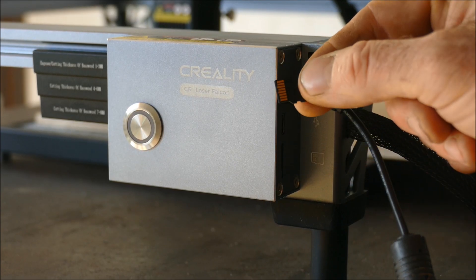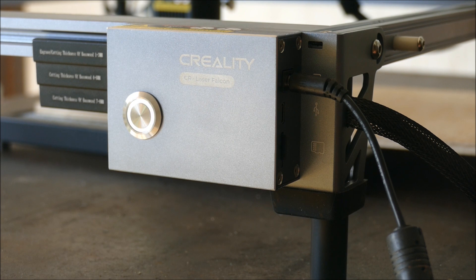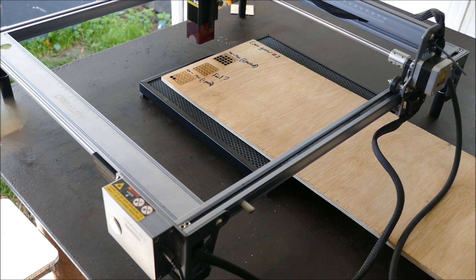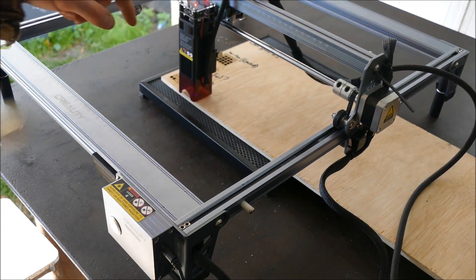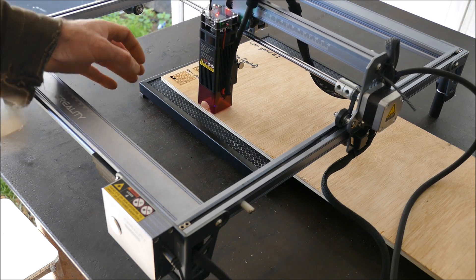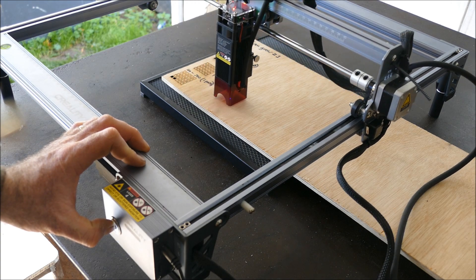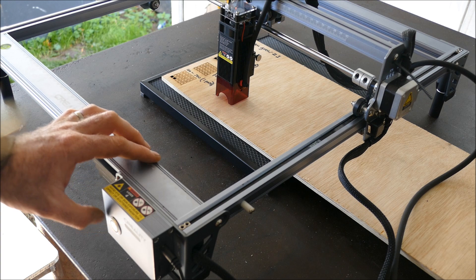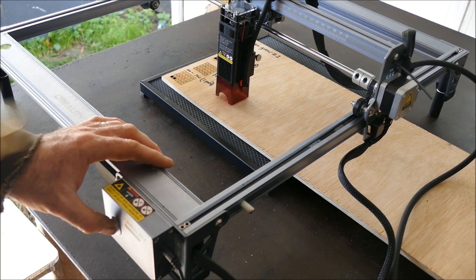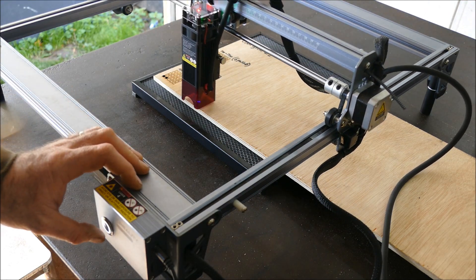Let's now test Creality's cutting capacity. We'll insert our SD card just in here and turn it on. Those beeps let me know it's ready. So the first time we press the button the machine homes itself. Now it's found where the cutting part is on the file and it draws a line around it and continues until you're ready. You can adjust your things at this point. Now I can press and hold to cancel. If we try that again, I'll press once, I'm happy with where it is, so I'll turn on the pump and press again to start the cut.